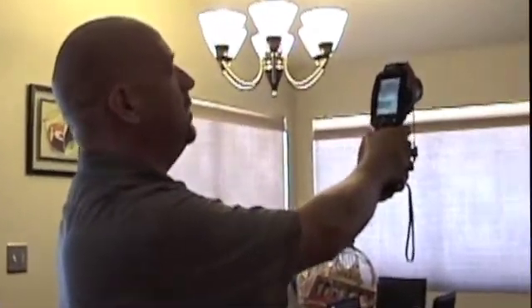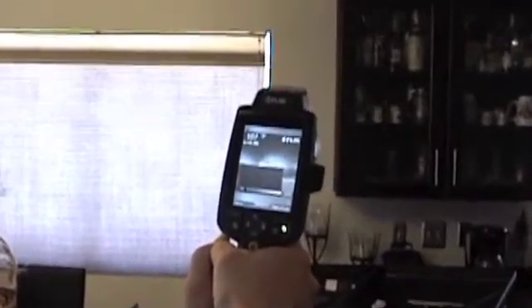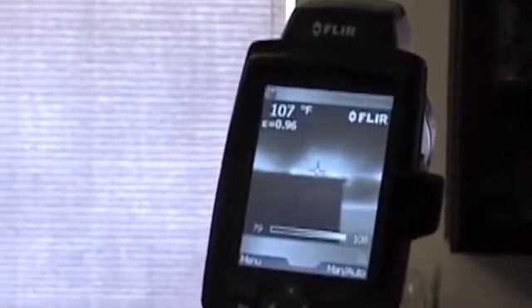That's the temperature of the air coming through on top. The highest temperature we've got right here is about 90 degrees. Mind you, the house inside here is sitting at 74, so we're getting a lot of air infiltration from there. The camera we have right here — as you just have the picture, we'll have it for later reference. We've got a section of the wall up here that's actually over 100 degrees. As I move around, it also moves the temperature. At one point it was 107, 108 degrees — so obviously that's not very good. You can actually see where my laser pointer is — that's above the cabinets there, where we're getting the infiltration. So we either have insulation that's missing from around here, or we have a gap in the insulation.